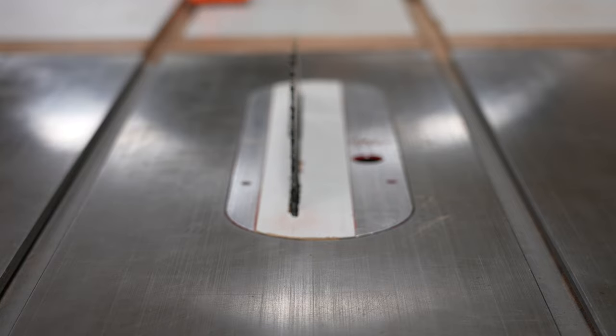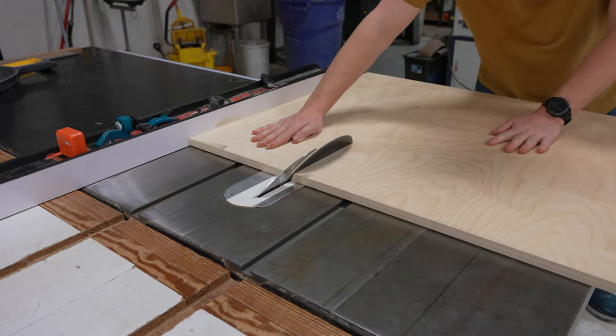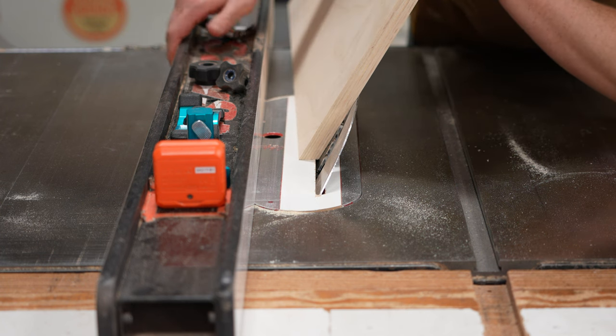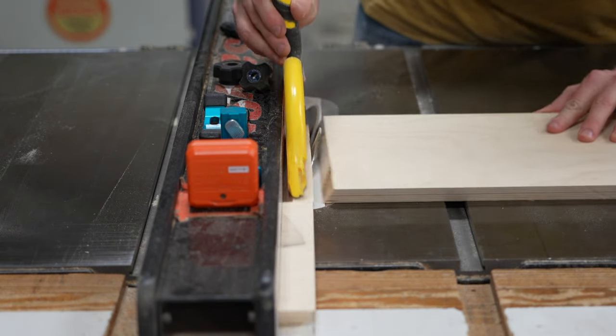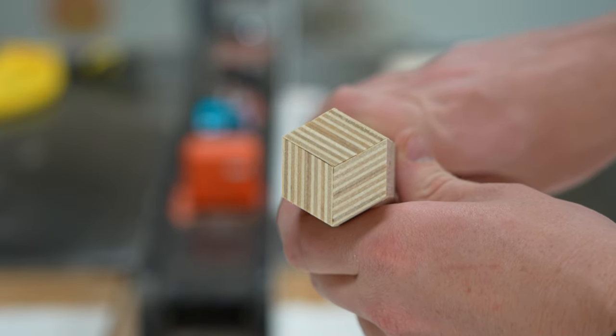The first thing I'm gonna do here is to make a test panel just to see what the pattern's gonna look like when all is said and done. I'm gonna be trying to make the hexagon pattern of pattern plywood — you can see a really good tutorial in Michael Alm's video, link in the description. Basically you set the saw at 60 degrees and set the fence exactly the width of the plywood and then you start cutting these rhombuses. Once you get the saw dialed in you should be able to put three of them together into this pattern.